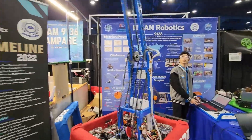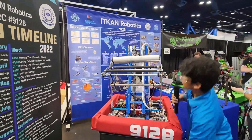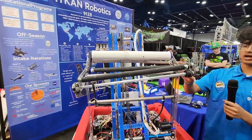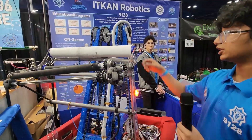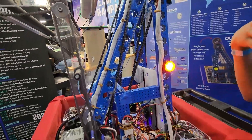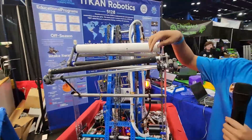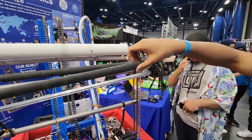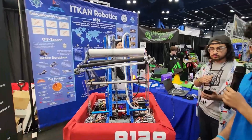The automatic stabilization is done through what we call our pivot system — it simply pivots at a small angle with a really easy pivot joint, and our rope tensioning at the very back of the robot pulls it taut so we have the perfect flip. Another really cool part of the intake is the idler pulley system — as you can see here, it reverses the direction of both rollers, which allows us to easily pick up any cube or cone in any position.